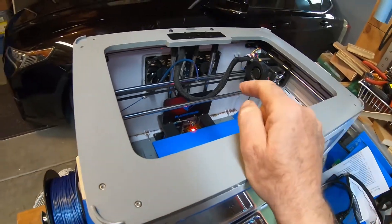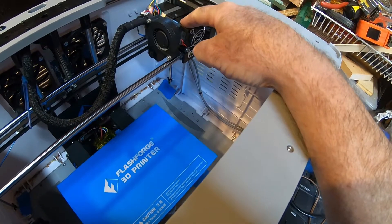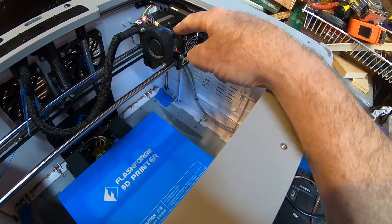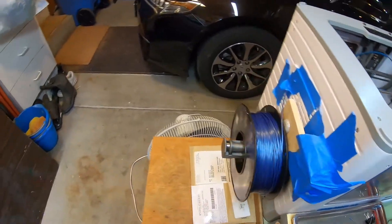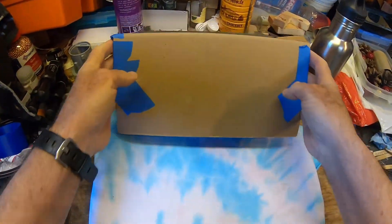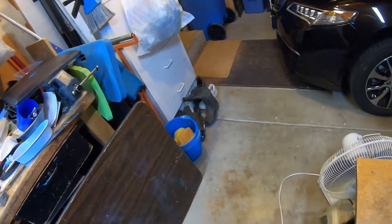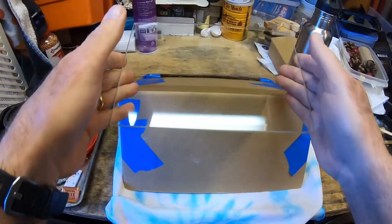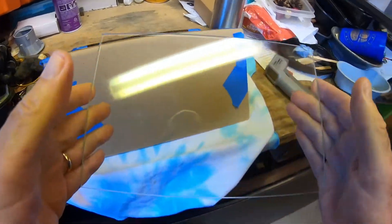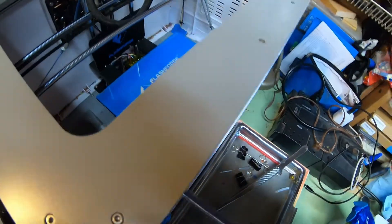I take it back inside. My printer is already preheating — I'm printing the bed to 55 degrees. I can touch it with my fingers without burning myself, and the extruder is at 225. I kept the printer heated from a previous print, because you want to keep it heated the whole time you're running. Anytime you let it go down to room temperature it's more likely to clog, since there's still some filament left in there even after you clean it.